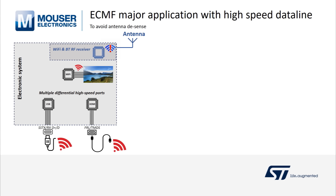Let's see one example of eCMF application. You can see an electronic system with two high-speed connectors, USB Type-C and HDMI, but also some high-speed data lines for the display. There is a risk of noise disturbances coming from the high-speed data lines that we call common mode noise. This noise radiates through cables or flex, and can have similar frequencies as RF signals — Wi-Fi and Bluetooth in this case — risking antenna desensitization.